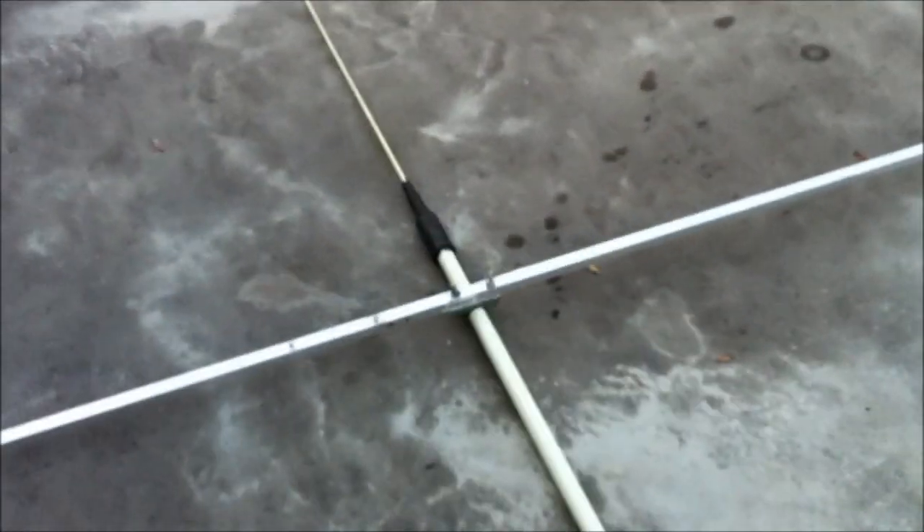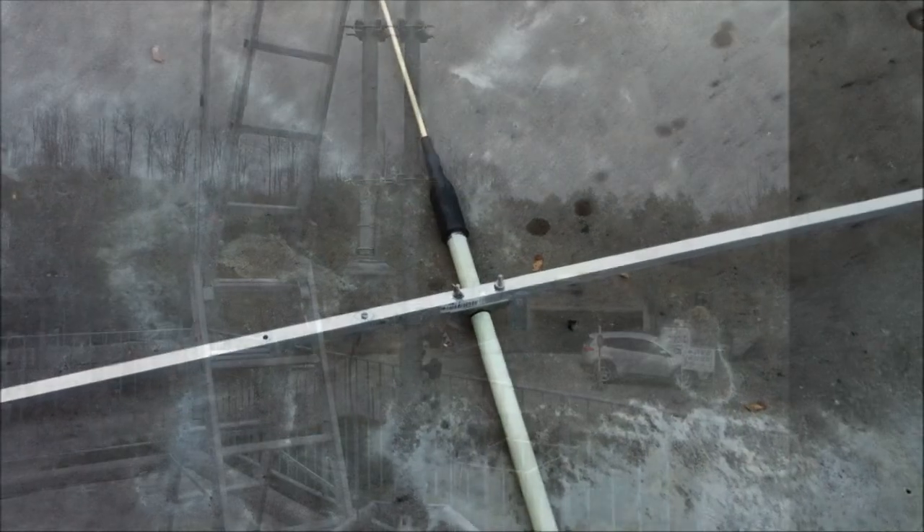About 570 centimeters. This is the feeding point of the coax antenna Big Stick, and the director is about 540 centimeters. Now I will put this beam on the rotator on the mast. See you later.